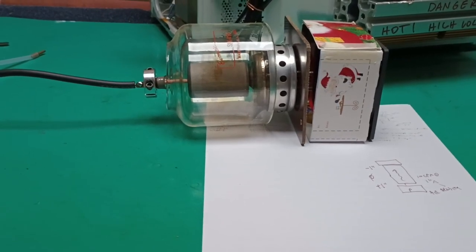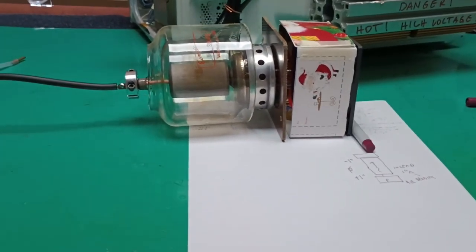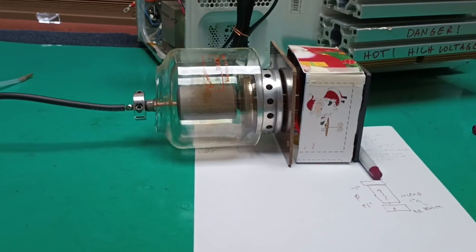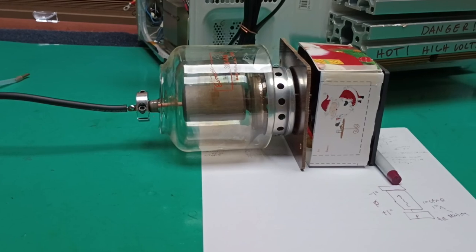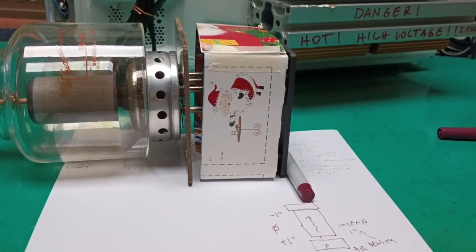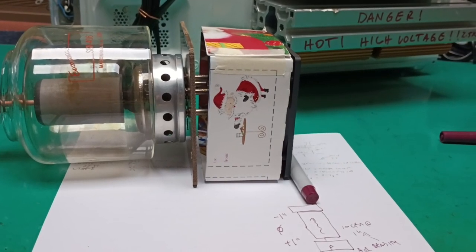There's a similar principle with semiconductors like diodes. We can't put them in parallel without going to a lot of trouble, because the one that turns on first will carry all the current. If the static pressure is too low, it's possible to couple two of those fans together. You need to experiment with the spacing, because I doubt that it's acceptable just to fasten them directly together. They may need an inch spacing.